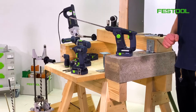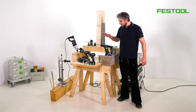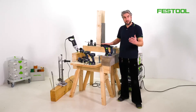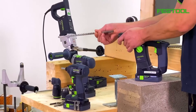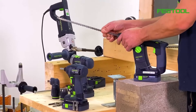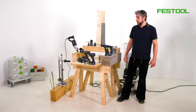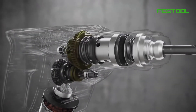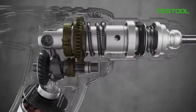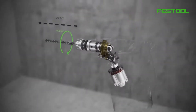I've already prepared a few machines, which I'd like to use to show you how they're different. We definitely need a hammer drill to drill boreholes into the concrete. We've also got a standard SDS plus holder, which means that we can drill boreholes up to a maximum size of 18 mm. The drill hammer has an integrated pneumatic axial hammer mechanism, which means that the runout follows in the axial direction and this aids the drilling process.